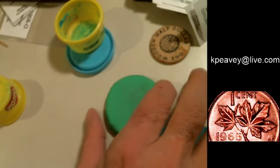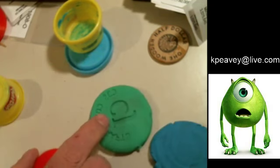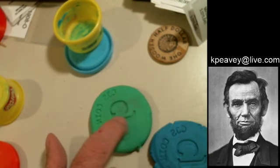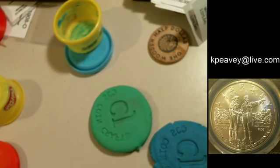So what I want to do, I'm going to make these into dies. Right, to make a die, you start with a hub. See that? You're going to press that into the die and leave an impression. Now a clash die, what you're seeing is you're going to see the outlines of one die on the other one. I got an example here we can show you.